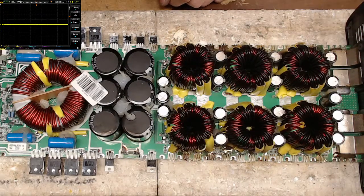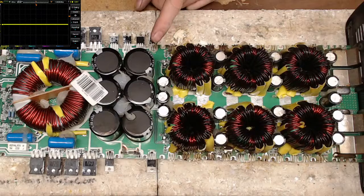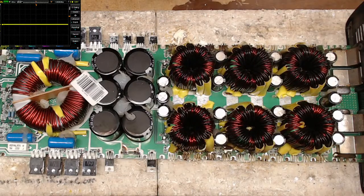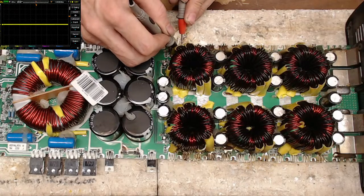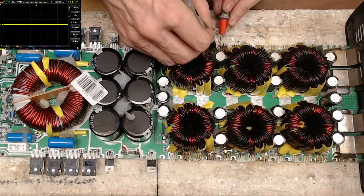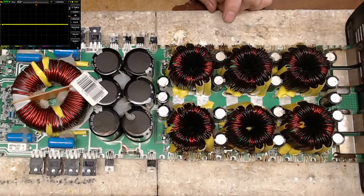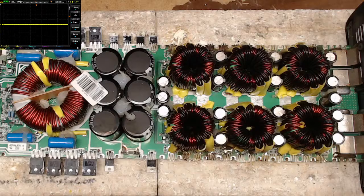So this needs a lot of new things. So this needs new 10 ohm resistors. On the gate drive ICs, it's going to need all new gate resistors. With this kind of fault, yeah, 4.9 ohms. Hey, 24 ohms. Yeah. So all new gate resistors, kind of like yesterday's, all new gate resistors, all new transistors. These are the 1404s, I do believe. I have already forgotten from yesterday's. Oh, wait, I just cut them all out. Let me see. 1404s. Yes, they are the IRF 1404s.